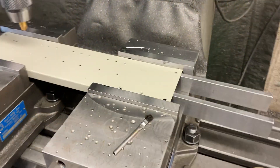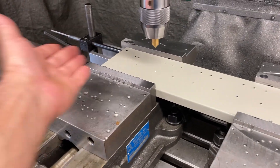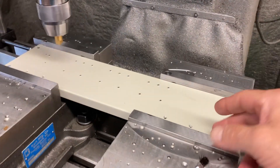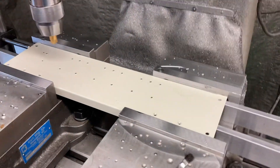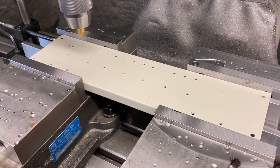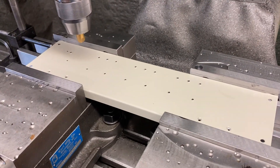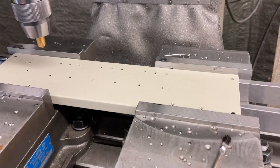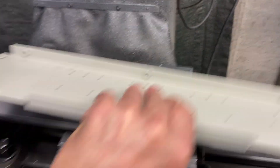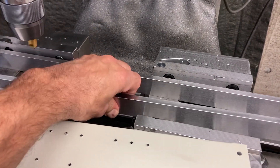So I changed my zero — this was my zero there. I'm stopping off the far end, like I'm not supposed to do, but I'm only doing one piece so I put it in there, edge found over here, zero'd, and did all of that on the first side. These parts are relatively good — done on a CNC brake punch machine, so they're within a couple thousandths. I just flipped it over, put it back in, working one-handed.